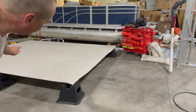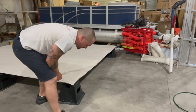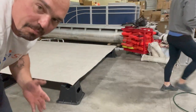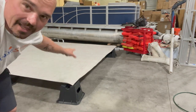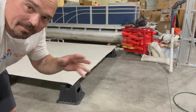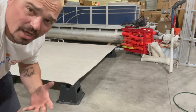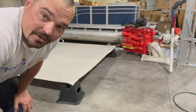So we've got it worked all the way down - everything is good and stuck. I'm going to take my razor, a good sharp razor, go around and trim the excess. And if there are any spots that are peeling, this is going to get a deck trim that will help hold everything down. If you have a big corner that's peeling back - we had that on one side - you just reapply more of that solvent-based adhesive. The solvent will break up the glue, reactivate it, and allow you to re-adhere it. We had to do that on one spot - not uncommon. We might miss a spot, waited too long, didn't wait long enough. I'm going to trim this out and then it's ready to go back together and go up on the boat.